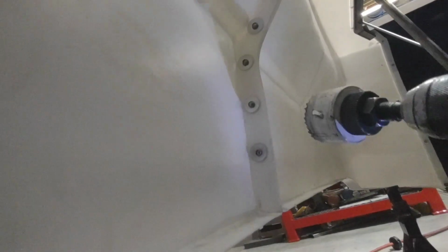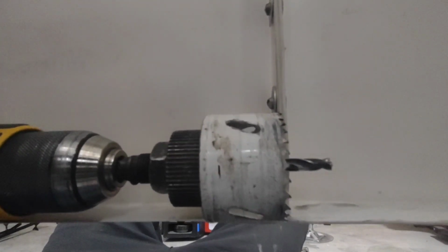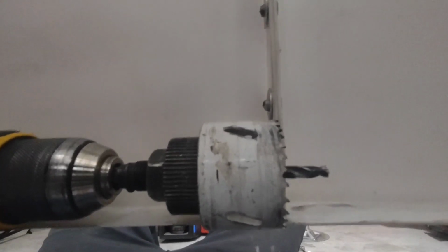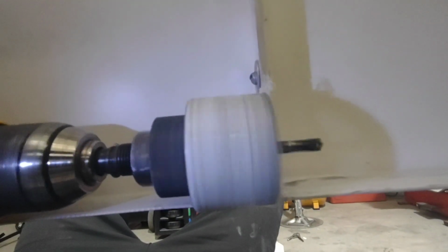It's nice and tight. To do this, make sure your drill is nice and flat against the bottom seam as well as the back of the bumper cover. Sometimes these seams are too tight to actually drill through with the drill bit of your hole saw. So just laying it down in there and cutting it is actually a pretty decent way to go about it. Cut through the first half going one direction and then come back through the other side and drill the other way.